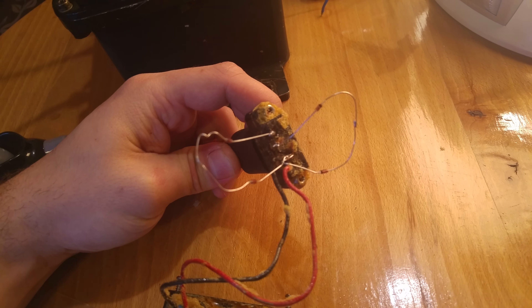We've got our charging status on the DCCU, because I finally finished my battery. I repainted it — it doesn't look beautiful, I should have sandblasted it. I rewired everything because the battery leaked and the alkaline completely damaged the wiring, so I was unable to solder to the original wires.